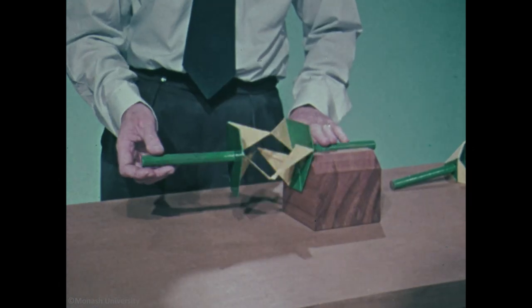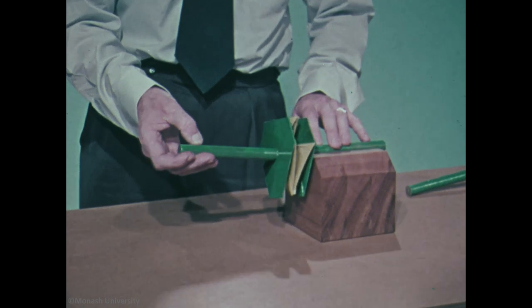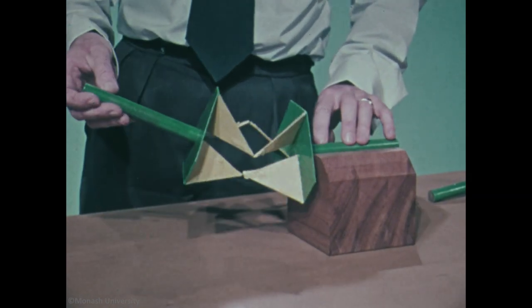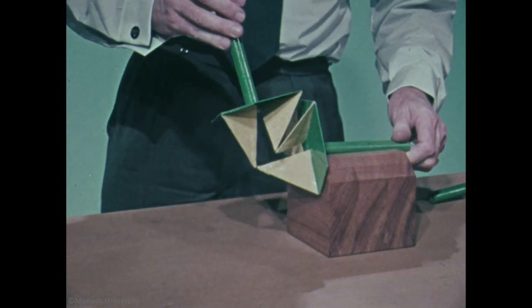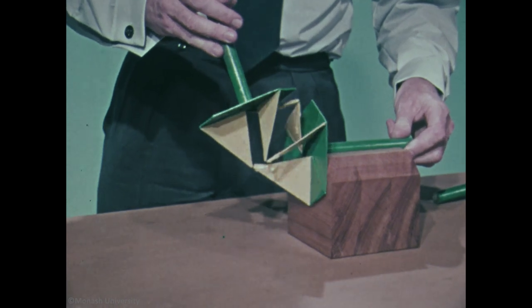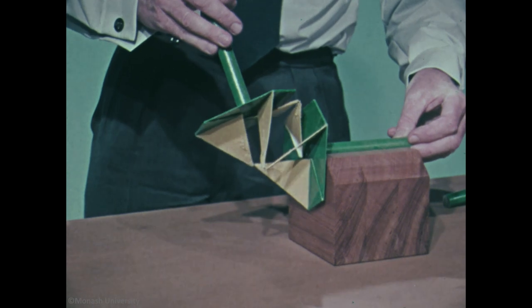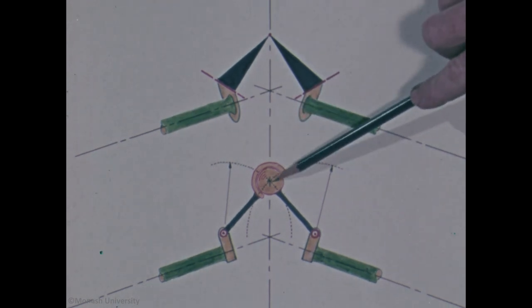This one's based on a tripod too, but designed so that there's a remarkable amount of plunging within quite a small overall diameter. It works even when the shafts are at a full right angle to one another, but when angled as far around as this, there isn't much scope left for plunging. One always seems to lose plunging as one gains angularity. These cardboard models are of course no good in real engineering, but they do show the movements that you can get with proper hardware. The tip of a tripod leg corresponds with the center of a ball cup joint, which is often used as an engineering component.